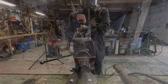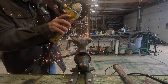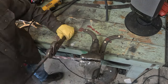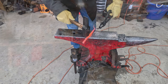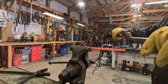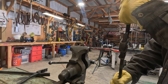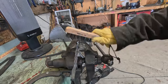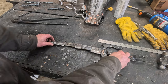Now, the pineapple twist: there are quite a few ways to decoratively twist metal. Normally I just do a straight twist, but the pineapple twist is where you cut a groove lengthwise on every side of a square piece of stock, twist it, heat it back up, flatten each side so it's square again, then cut another groove lengthwise on each side, heat it back up, and twist it back half the distance of your original twist. What I like about the pineapple twist is that it is the most bony-looking of all the twists — they look like little bony claws, which is exactly the effect I was going for.